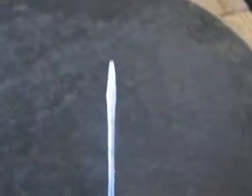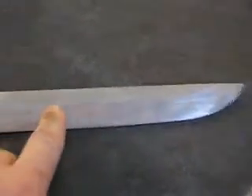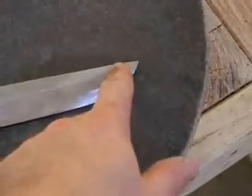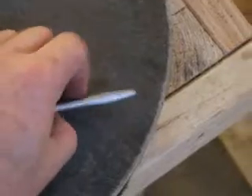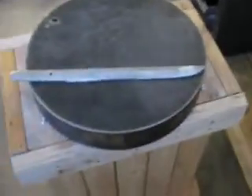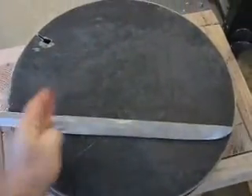You can see that those two lines form a wide point right there. There's a wide point in the tip of the blade, and that's nice and symmetrical. That wide point is created by the Shinogi line as it runs along here and then curves upward, and where the two Shinogi lines meet at that point, it creates kind of a wide spot — and that's very symmetrical. So I think I've done a reasonable job with Shinogi Zukuri geometry in the blade portion.